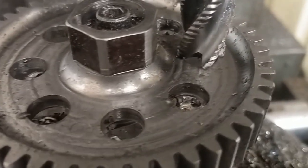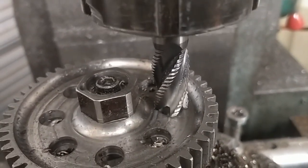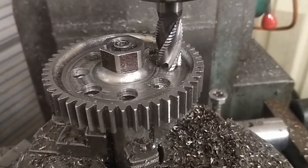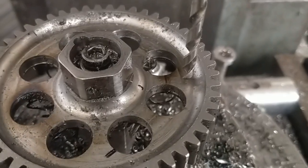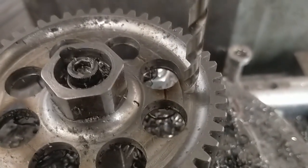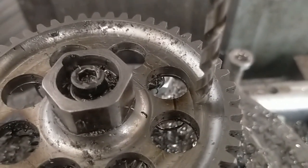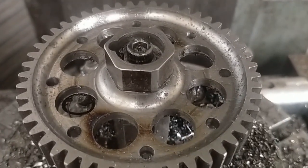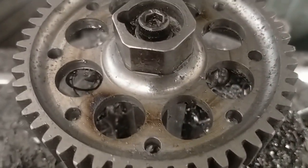So I've pilot holed it with a 12 or 11, and now I'll go in with a 16mm roughing end mill at 630 RPM, then we'll see what we can do about putting a hole up here in the spandrel. We had a bit of overheating on the blunt end mill, but it looks like we can fit a 5mm drill up in the corner of that spandrel. So aside from deburring everything, that's removed enough weight without compromising the strength.